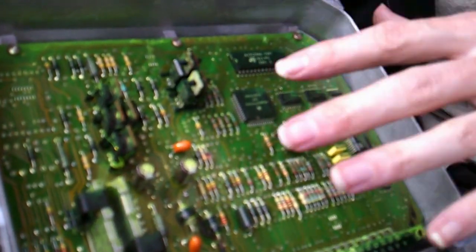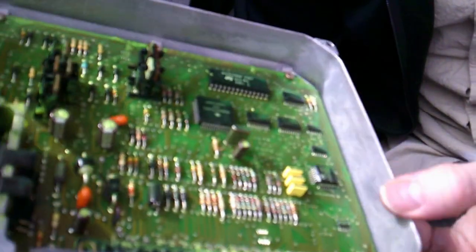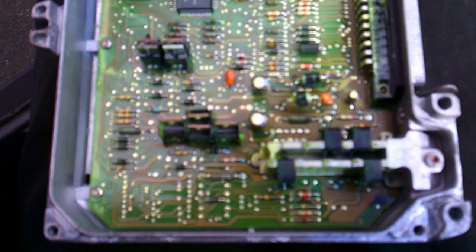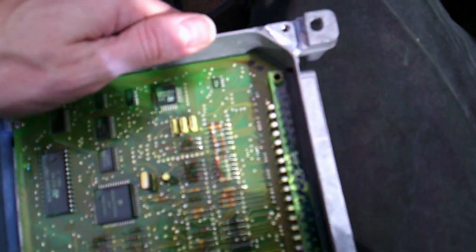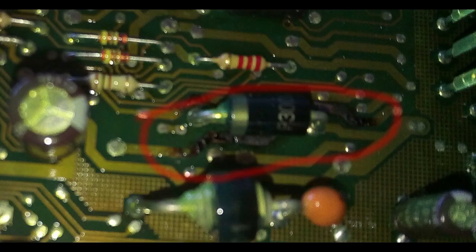Now the trick is to start looking on the board for any problems. We've got the various transistor outputs, the main chips, capacitors haven't bulged — that's a quite common one to check on things like this — so they look okay. I'm going to have a closer look at this, maybe take the board out, take a really good look at it, and I'll let you know what I can find. Looking over the board and doing a quick overview of it, I have spotted what looks like it may be a problem. It was difficult to get the camera to focus on this, so I've taken a few photos of it.